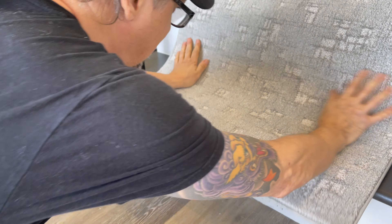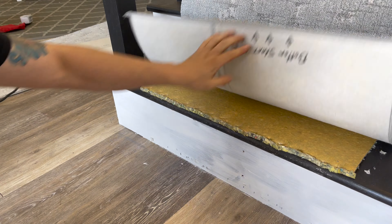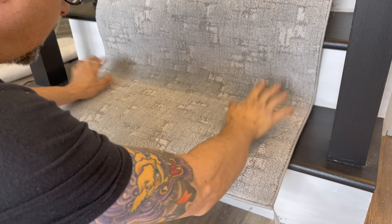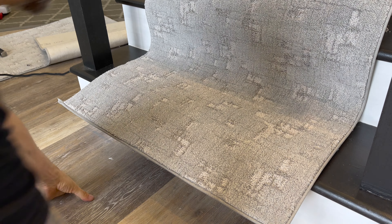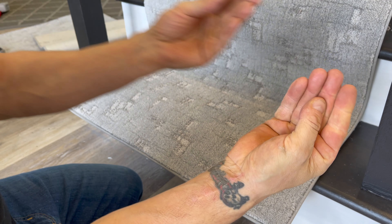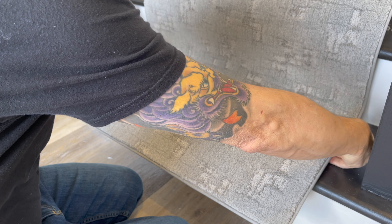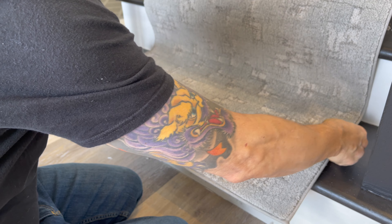Now what we have to do is we've already centered our under pad. If you watch the video on how to install pad for a stair runner, it's going to show you how to center it. You can see that we've already centered our under pad here. We're going to center our stair runner. If my stair runner is 28 inches wide, that means my under pad will be 26 inches wide, leaving an inch on each side. I like to take the tips of my fingers — that's about an inch with my thumbs.